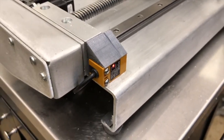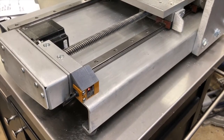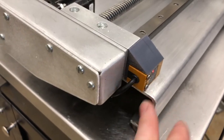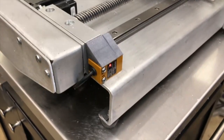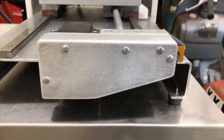These are normally closed — that's why the LED is on — and NPN. It was a pain to make them work. It wasn't going to work without an intermediate circuit. Me and an electrical engineer at work spent an hour or two figuring it out. We ended up putting in a couple of opto-isolators and had to power those separately. If you're going to do this, I recommend it — they're reliable, no metal shavings or oil can interfere. Just get ones that hook right up to your board.